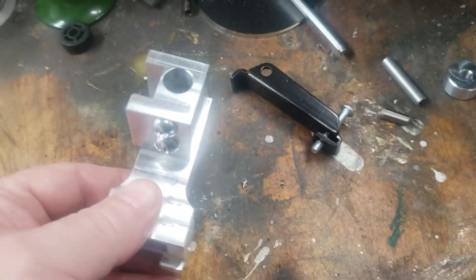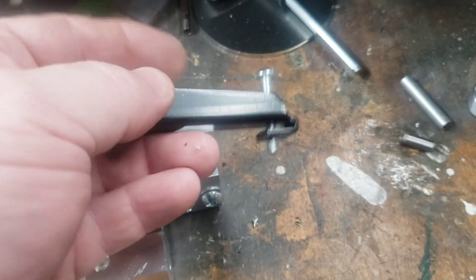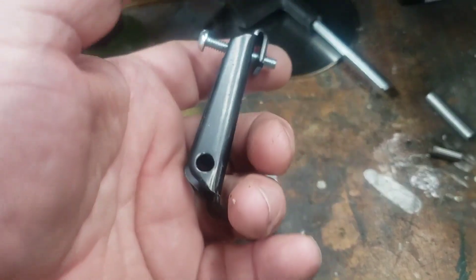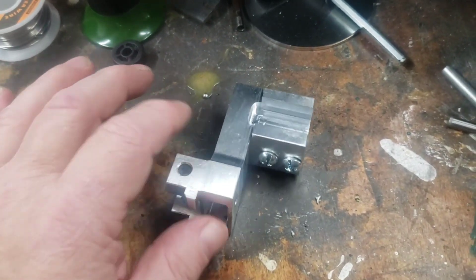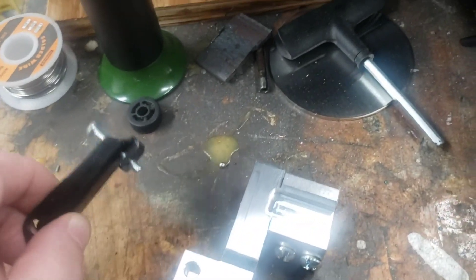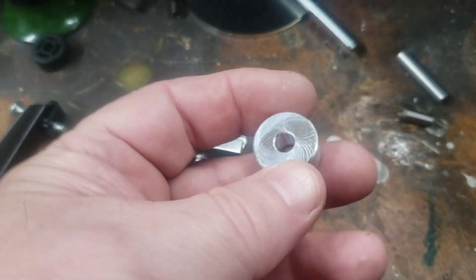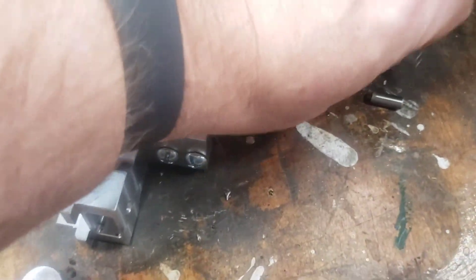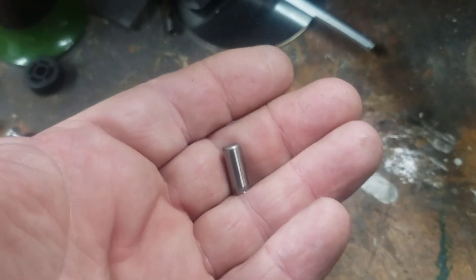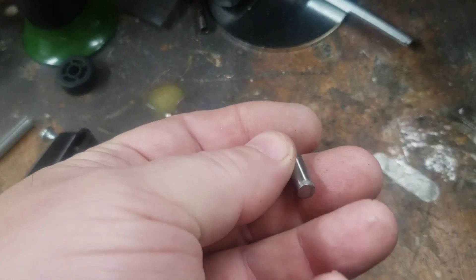So the parts you're going to need: the rear fence clamper bracket and the clamper lever. This came with the kit. If you order just the bracket, you're going to have to strip the old one off your original, or the seller offers these. They have upgraded aluminum rollers instead of the plastic one. The kit comes with the drift pin for the lever, and these are the axle pins for the roller.